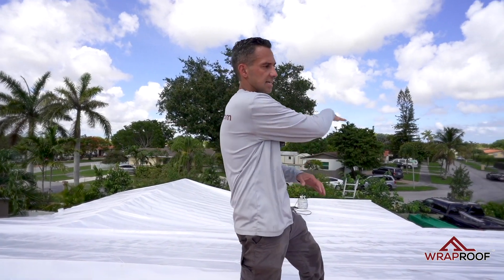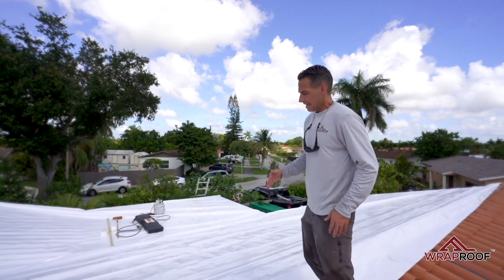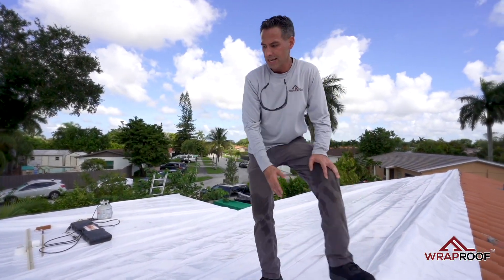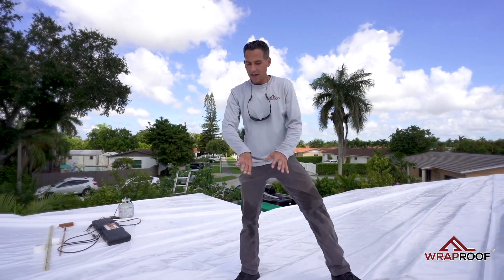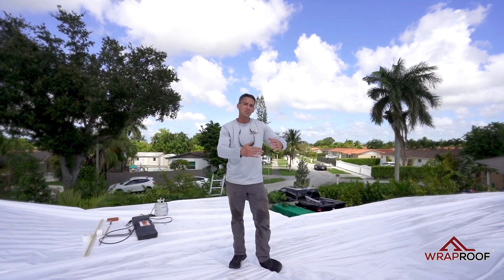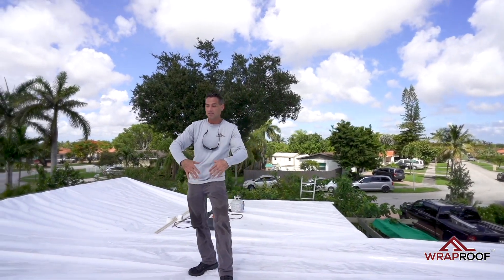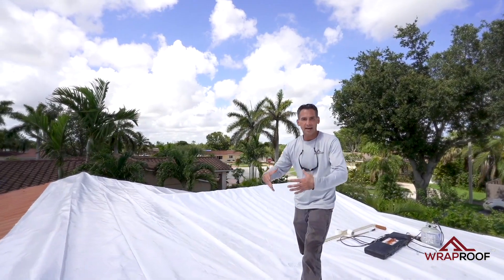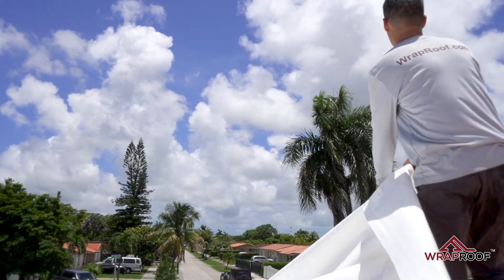Normally we don't like to do a horizontal seam — you want the seams to be vertical. The reason is because of weight. Imagine your seam ends here and doesn't go over the ridge on a steeper pitched roof. That's a lot of weight spread out over 60 or 70 feet, and over time, if your heat seam isn't strong all the way across on a six-pitch roof, it'll start to cool down and after a year that seam could break, leaving an opening in your plastic.